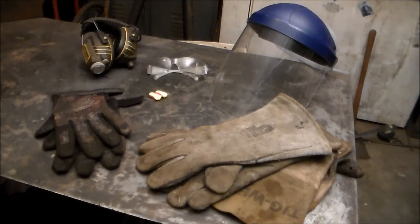You need eye protection, of course. You need the appropriate boots for what you're doing. If you're using a cutting torch or welding, you need a very slick boot that won't hold pieces of slag. If you're dropping a bunch of timber or handling a lot of steel, you're going to want steel-toed boots, maybe even metatarsal boots. Sometimes you might need boots with a steel shank in them. So think about all these things, including your clothing, because the best medical emergency is the one you don't have because you took precautions.